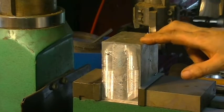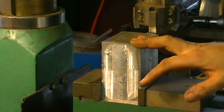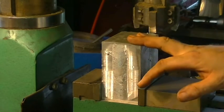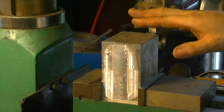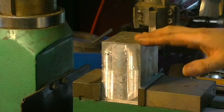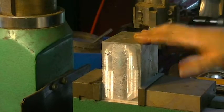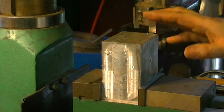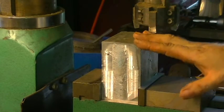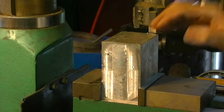I'm on the last side — five out of the six sides are done. Once this is squared off I can start doing my layout. Now, this is taking me a lot of time compared to somebody who has experience. I'm being very slow and cautious, feeding the material through very slowly because I'm not sure what the capabilities of this cutter are. I know it can machine steel so I don't have a lot of issues with aluminum. You want to get your feed rates somewhat consistent and have the best cut possible. I found out that if I speed up just a little bit, it doesn't give the aluminum as much time to heat up and it actually cuts better. So I've increased my feed rate a little bit. I'm still turning it by hand, and I'm grateful to have the opportunity to use this cutter on aluminum for my first time because it's giving me a lot of good information. I'm learning a lot, and that's what being in the shop is all about.